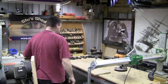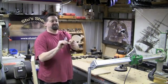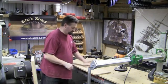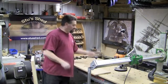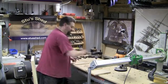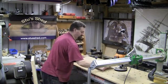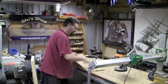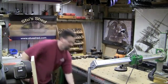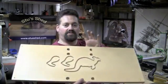I have my pattern. I have this original object that I want to copy — in this case it's one of the pieces from Keith in engineering; he does a racing kangaroo, and this was one part of that. I would secure that down, and I would either screw it on or use some form of fixing to that surface. I put a couple of rails on either side just so it has no tendency to rock whatsoever. Then with the router bit lined up directly above the pin, I would flip the whole thing over, hold it up against the pin, and go all the way around — a very light pass initially, then plunge it a bit deeper, until I cut a nice track. Once I've done that, remove the originals. And this is my final one — you end up with this, and this is my original track, or template if you like, for cutting future copies of the racing kangaroo.